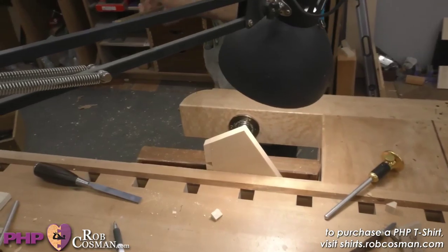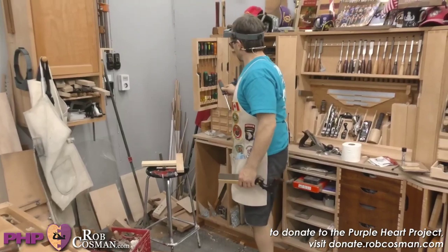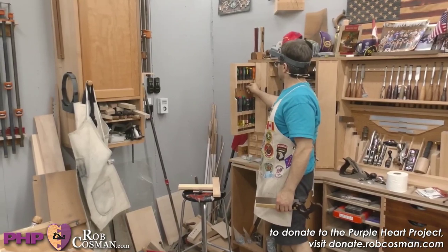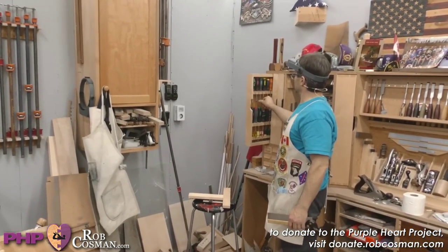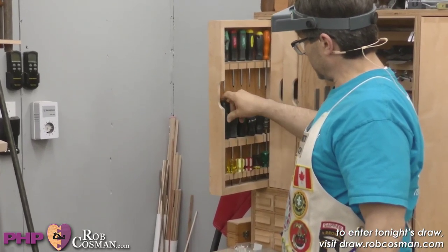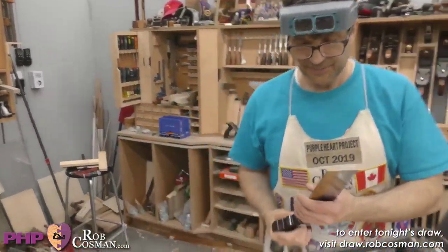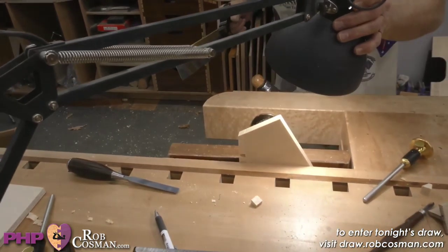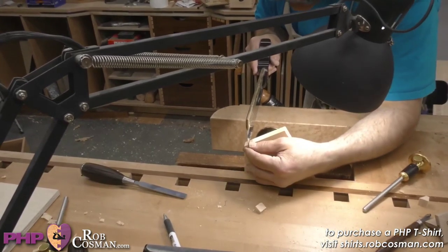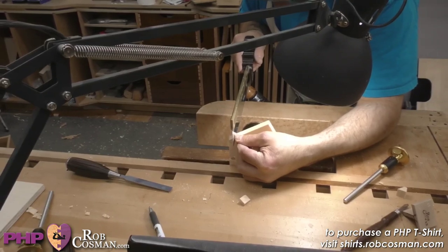And we'll have them in, in case you're just new to this, Robertsons have four sizes. They have zero, which is yellow. One, green. Two, red. And three, black. And there's a little scale on the size of screw. Now, when I say size, I mean the shank size that it works with. But they all have that same characteristic and just pleasure to use. Not as fun as dovetails, but they are good.